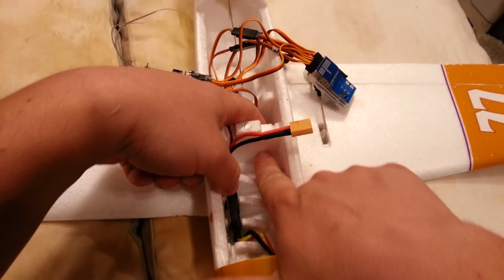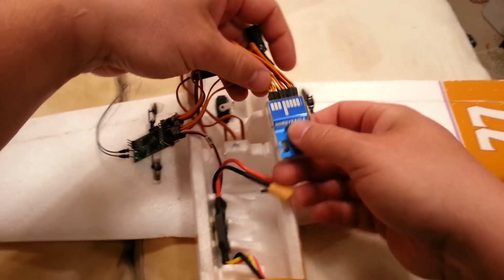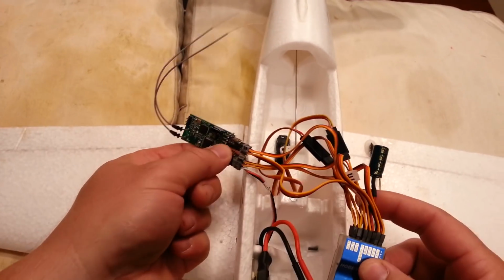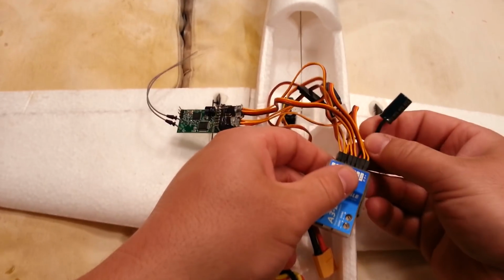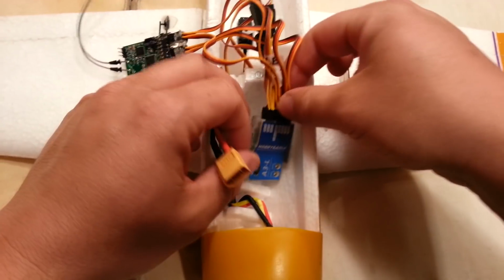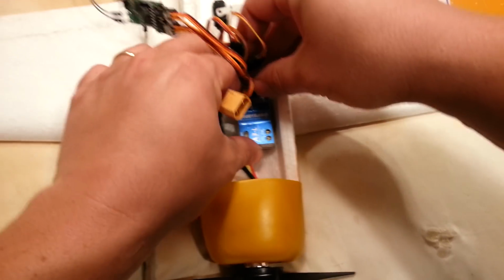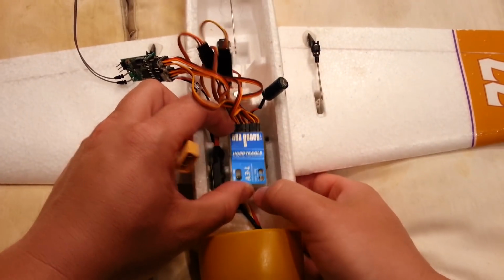Maybe what I'll do is I'll just cut a big hole for all these wires, this whole chunk of wires and the little capacitor to come out. By the way, that capacitor can plug in anywhere on the receiver as well. It doesn't have to plug into the A3L. In fact, it probably shouldn't plug into the A3L. It'd make better sense to plug in over here. But for now, let's just do this. You see what I'm talking about? I want to drop that down in there so that it's situated as close to center as possible.